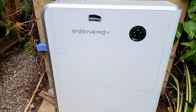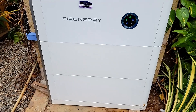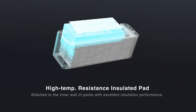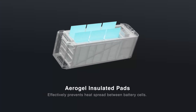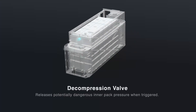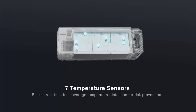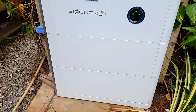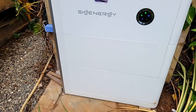These batteries have seven sensors implanted within them. There are three packs and each pack makes up a group, wrapped with a thermal gel cell. They also have fire extinguishers and pressure release valves. If temperatures go beyond what the sensors consider normal, or if pressure builds up, the pressure release valve vents it out. If temperatures reach a dangerous point, the extinguisher goes off and that battery is dead — but the other one continues to function at reduced capacity. You do not notice the difference.